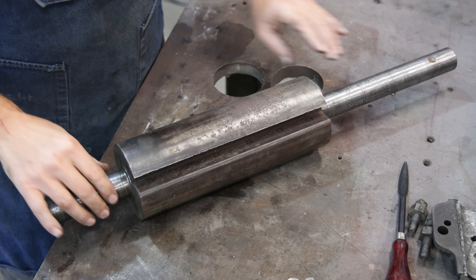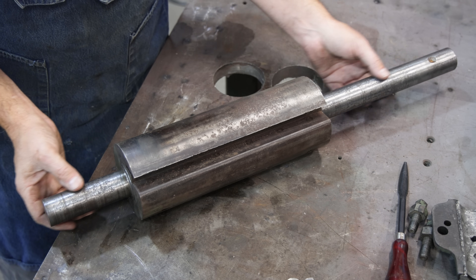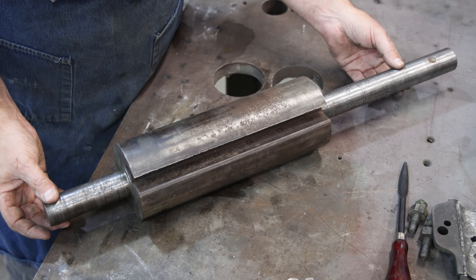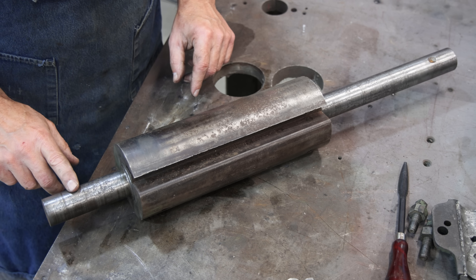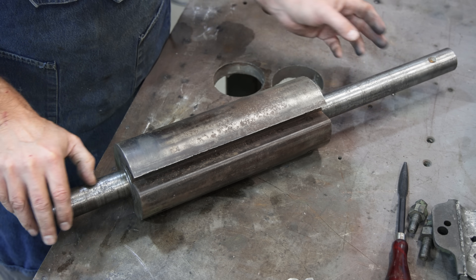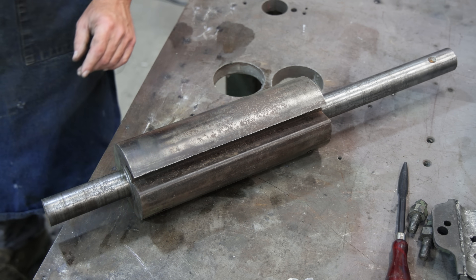The other thing I'm going to evaluate is the shaft running in there. There's a little bit of tarnishing on this. Running my fingers on it — it's not perfect, but for a Babbitt bearing it doesn't have to be perfect. It's going to wear in if there's any indentions. This is not bad at all. If the Babbitt bearings were really bad, you'd see a lot of scoring on the shaft. I do want to take this over, put it in the lathe, and just polish these — hit it with some emery cloth real lightly. I'm just trying to make sure everything is smooth more than anything else. For a Babbitt bearing, it's low tech — this is going to be just fine.